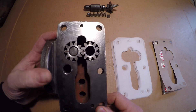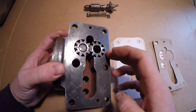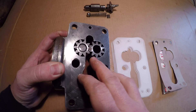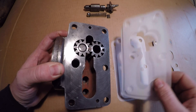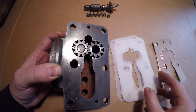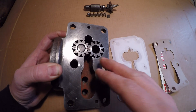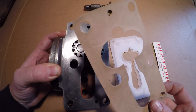The last thing I need to do is set the end-play clearance of the pump gears to the engine block. I've already verified the clearance between the gears and the pump housing is really good — everything's still within spec with very little wear. To set the end-play of the pump gears you need to do that with gasket thickness. I have two options: pre-cut three-thousandths thick shims stacked as necessary to reach the desired two to four thousandths end-play, or a single paper gasket if I can get away with it — which is the route I'd much rather go.